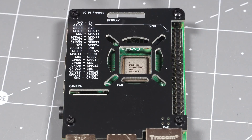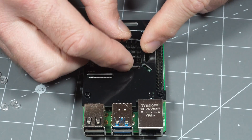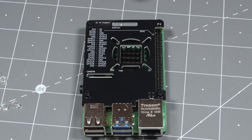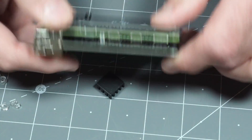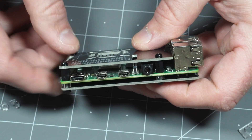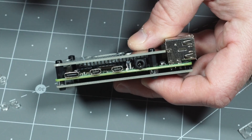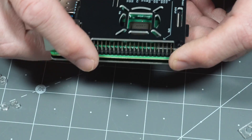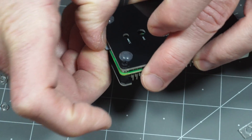Also got a slot for the camera and a slot for the display. Of course, you've got space for the fan here, but you can also use a heat sink if you like — kind of an or-thing. So it's right in there, just about flush. With a fan or without a fan, you can use that. Pretty neat. Then you've got access to all your ports: USB, HDMI ports, the stereo jack, USB, ethernet. And of course, you've got space for your GPIO pins, which are nice and labeled, and your SD card slot.